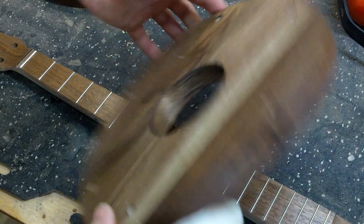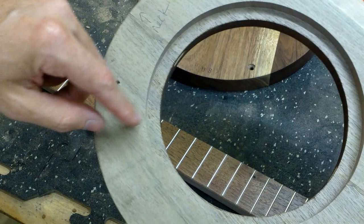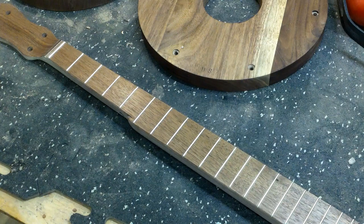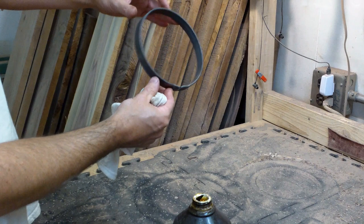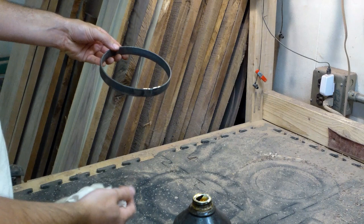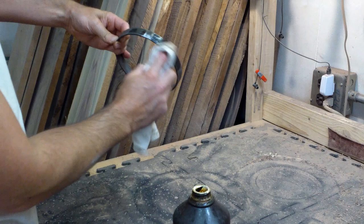I'm only varnishing the outer surfaces — there's no reason to varnish the inside. We especially don't want to varnish this inner lip here, because we'll be putting glue there and we want it to be able to stick to the wood. I'm going to let this first coat dry three or four hours, then add the second and third coats the same way. This is the steel tone ring included with the mountain banjo kit. I hand-roll these and weld them myself. It is plain steel so I want to give it a little bit of protection — we'll be putting a wet skin on it, so let's coat it in oil as well.